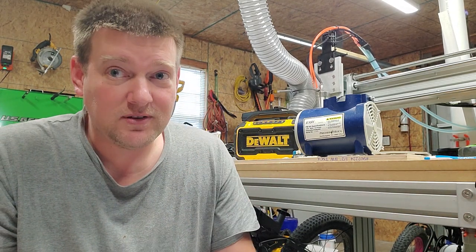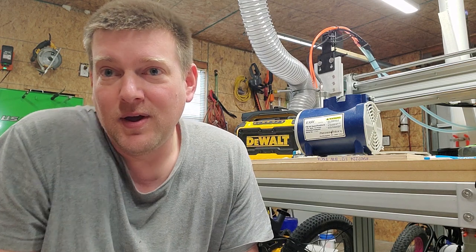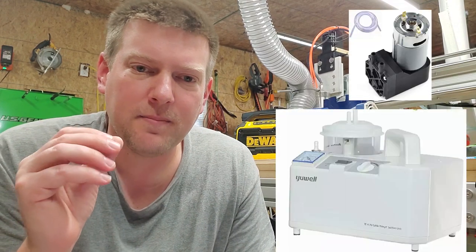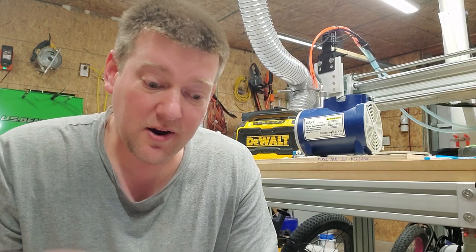Diaphragm pumps are the least efficient type of vacuum pump, and they are generally very cheap to maintain and easy — that's why most people use them. You're going to find these little diaphragm pumps all the time in compact suction units. Not only are they cheap, light, and easy to maintain, but they can handle liquids. In a compact suction unit, what are the odds during a trauma situation that your vacuum reservoir overflows and some liquid gets back into the pump? It's possible, and there are some pumps that would completely destroy. Whereas with a diaphragm pump, you just rebuild it and press on. They are the most common type of pump — you will see them absolutely everywhere.